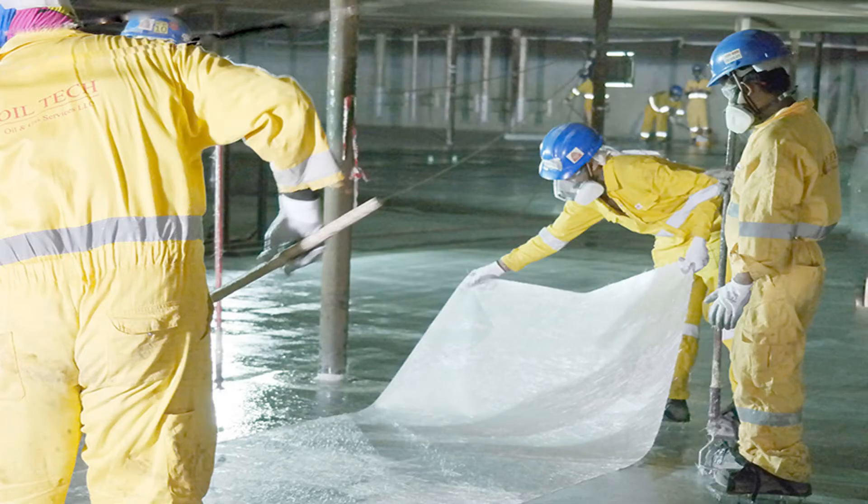The recent trend has municipalities shifting away from replacing tank bottoms and toward the application of fiberglass lining systems where recommended. Installing a lining system means applying a primer, catalyzed resin with a glass mat, tissue, and a seal coat.